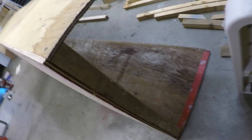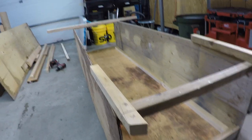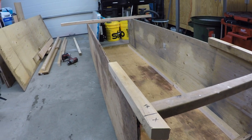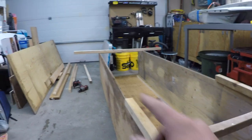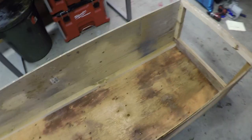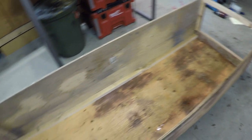Bottom cross pieces and braces are installed. This is the bottom of the box - you want to make sure you're screwing in all directions, so flip the box onto its side and screw it in from the bottom. Cross braces on the top end have been installed front and back. I've marked my risers and will cut them on all four corners. The reason I'm doing this in sections is because my saw is outside - there's snow outside and it's cold - so I get all my measurements, go outside and cut it all, then close the door and install it.